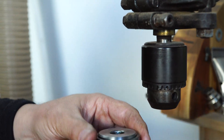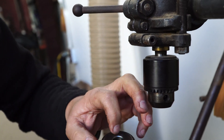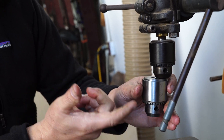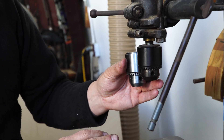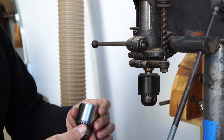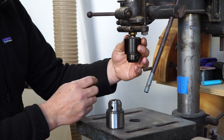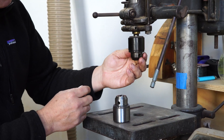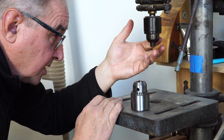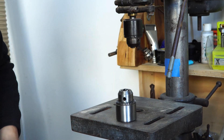If your chuck just falls out it's just because it came loose in the taper. To put it back on, you don't want to lube this for sure. You want it to be dry — get some rubbing alcohol, clean it really good on both sides. A little tap with a hammer and it won't come out for another 50 years. So this one's all lubed up, feels good, we just got the wood dust out of it. It's still operating — spins well, runs freely, jaws look pretty good. No need to fix that one, still working. See you soon, thank you.